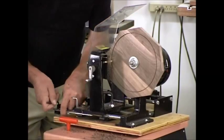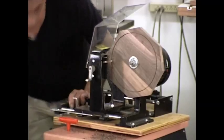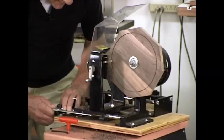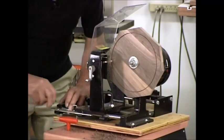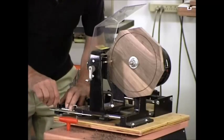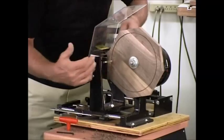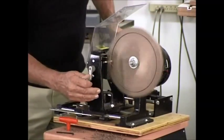Okay, we're into position. We'll loosen the index pin and get it so that it fits down into the index pin hole, then tighten this back up. Now we have a steady reference, and we know that this is as far in as we can go without hitting these edges. So let's go ahead and make that other cut in there.